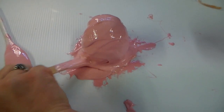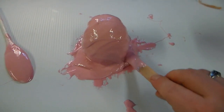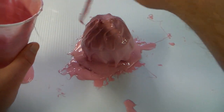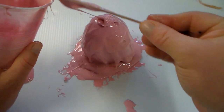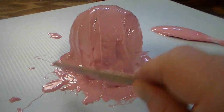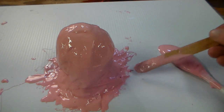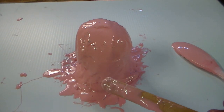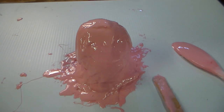I'm going to really make sure we get underneath this undercut on the back of the head and along the sides, because we don't want any air voids. Since gravity is working here, I'm making extra effort to bulk up the very top of the head because as this stuff drains down, that's the spot that's going to be the thinnest. I can tell by the way the silicone is reacting that I probably only have about one minute left to work with this. We're going to let this dry completely — if you used the accelerated Part B like I did, it should only take 45 minutes to an hour.